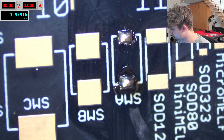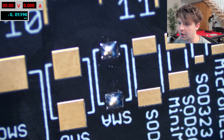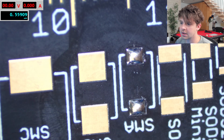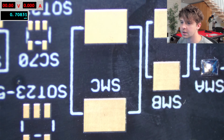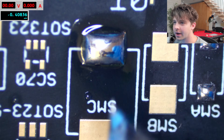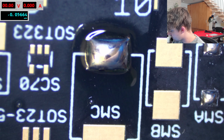That's a little bit nicer — a fair comparison. So the one on the right-hand side is our Kester solder and honestly I cannot tell the difference whatsoever between the color of the two. They both look like 63/37 leaded solder. The only difference I did see was the flux behaved a bit differently, and I think we're going to see that more on these larger pads. So I'm feeding more solder in here because there's not quite enough on the iron itself. This is one of the reasons I love this eutectic alloy — it's so shiny.